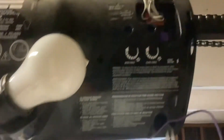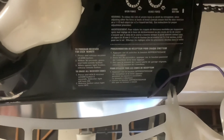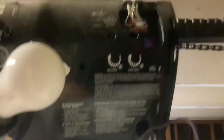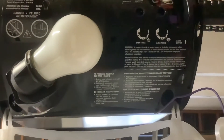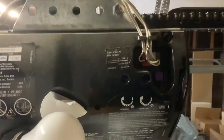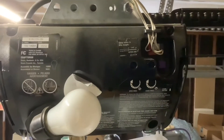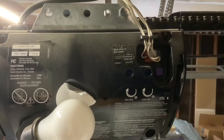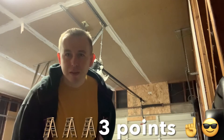If you want to completely reset the garage door and forget all previous remotes, hold the purple button for six seconds. If you just want to connect a new remote, press this button, then press the button on the remote and wait for the light to blink. It's really important to note the color of this button before you purchase your remote, because some remotes only support certain colors. When climbing a ladder, three points of contact at all times.